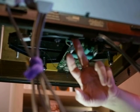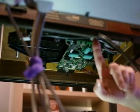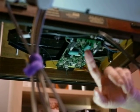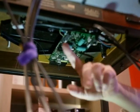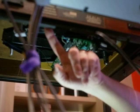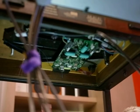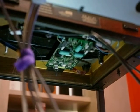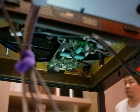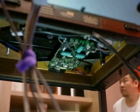Here's your tone arm cable. It's always clamped here. Always put a clamp here. One question that sometimes comes up is, what if I drill 2 holes, just run a very short cable to the plinth, and then just connect a phono cable? Simple answer is it won't work. You'll make a noise, but it won't be a very pleasant noise.